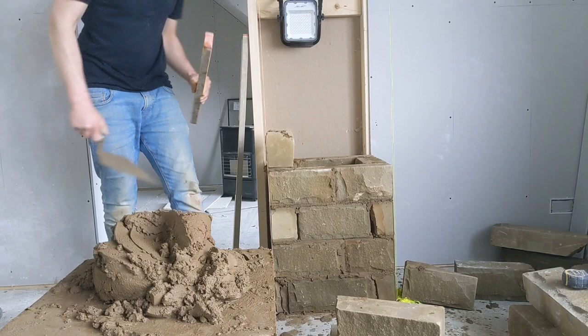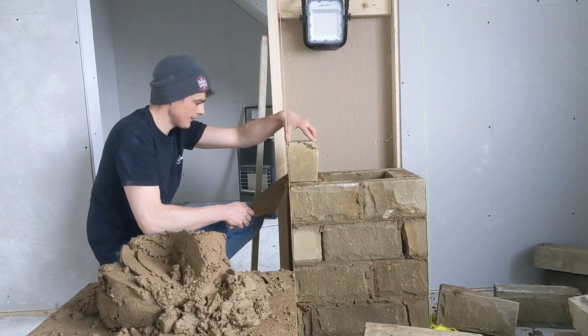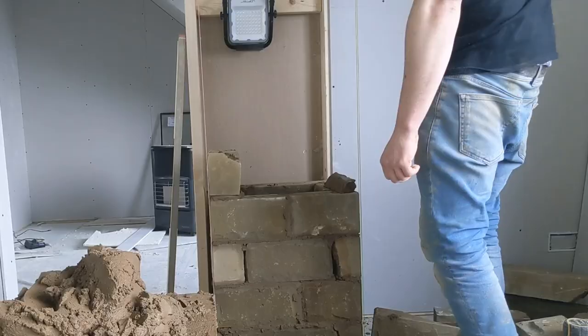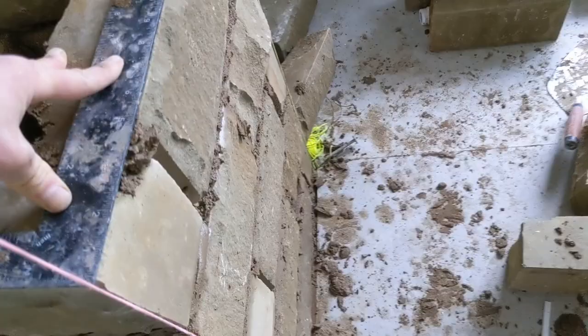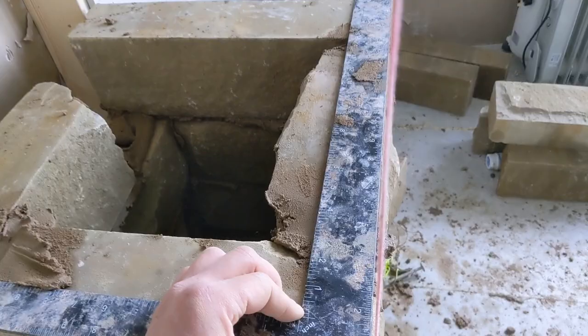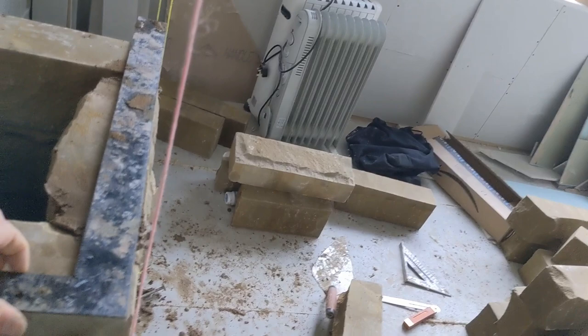All I'm doing is building to my lines — build to this line, this line, filling in that, and then working my way round with my square after. I'm following this board here, which is plumb, so that's like my third line. To make sure this one is in line with these two, I'm just using my square, touching the line and ranging it through. Then I'm just working my way round the corner, touching lines all the way round.